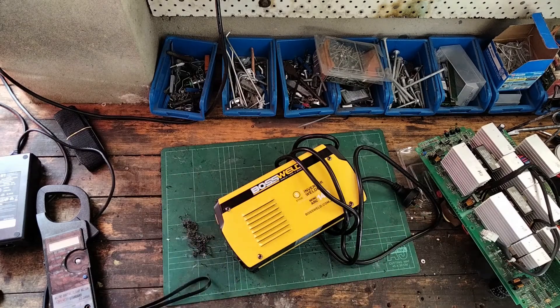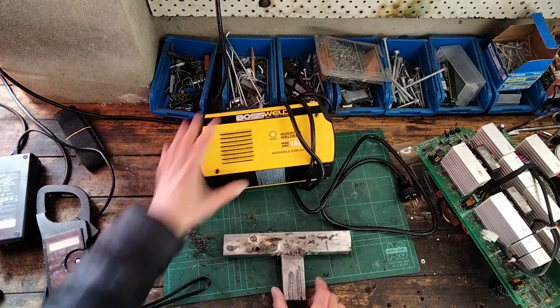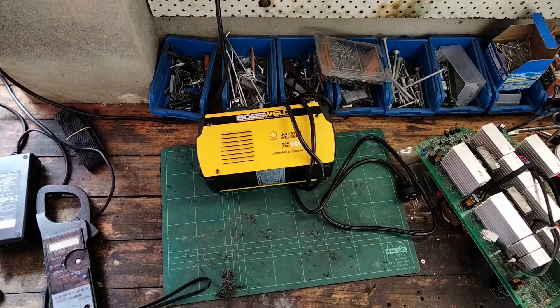So there you go. I'm not a skilled welder, but doing a couple of seam lines wasn't too bad. I did one line all the way across, and I blew a hole straight through the metal on the 140 amp setting, as expected — that's only for thicker metal. Thank you so much for watching, I hope you have a lovely day, and I will see you next time.